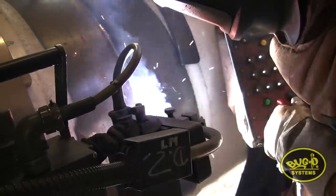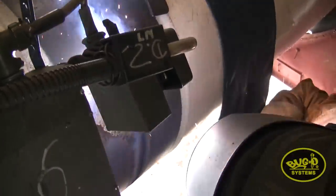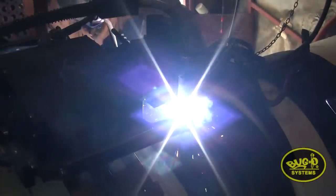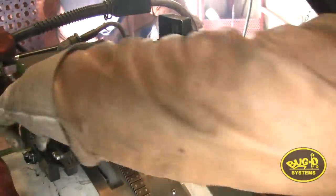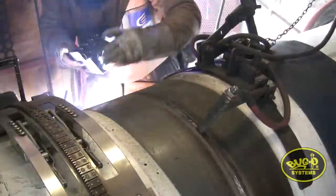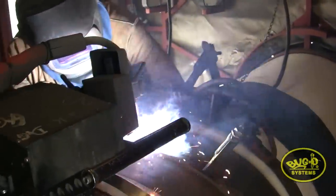The flux core welding process is a high deposition process applied in the vertical up progression. In order to avoid issues with both welders attempting to weld in the same location at the top or bottom of the pipe, different starting locations are employed. One welder begins at the very bottom of the pipe at 6 o'clock and welds upward toward the top at 12 o'clock. The second welder begins at the side of the pipe at 3 o'clock and welds to the top at 12 o'clock. Since there is less distance to travel, this welder will finish first. Once he reaches the top, he disengages the clutch on the tractor and moves to the bottom of the pipe. He grinds out the weld start he created along with the weld crater, then grinds the start of the other welder's weld, positions his tractor at the bottom allowing some overlap of the welds, and begins welding uphill to the middle of the pipe at 3 o'clock. The welder on the opposite side continues and completes his weld at the top of the pipe.